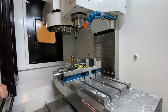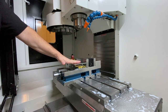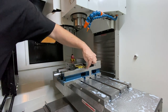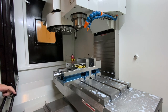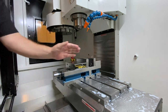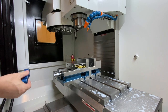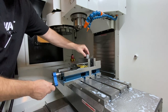Maybe you're experienced and you just are bored and want to watch some CNC related content. This is a CNC machinist vise and unlike a lot of the other vices that you may have seen that are similar in nature to this, you can see this one's surface ground here on the edge. So this is going to be tilted up on its end and that makes it relatively unique. I've got these dovetail jaws installed on this, and far and away this is my favorite setup. This is the setup that I choose to use more often than not.